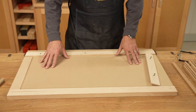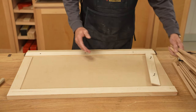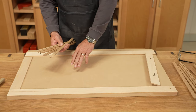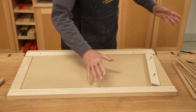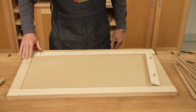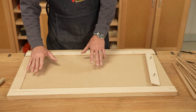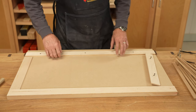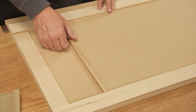The first step in making your tambour panel is we need to make a jig to hold our slats, to hold the individual slats. I've got a whole bunch of these cut and we're going to lay these face down inside this jig. I have made this jig the size of my panel, so if you have a larger panel the jig is going to be sized for that. I've got a right angle here so I can start putting my pieces in and it keeps the panel perfectly square. I've glued and stapled these down. This piece I've just screwed down but I've already adjusted this for the length of my slats — I want to keep them tight top to bottom.